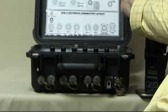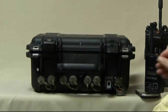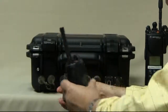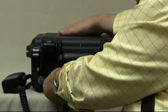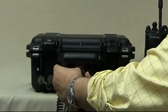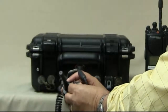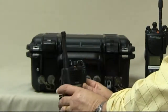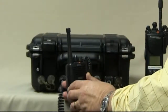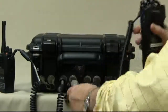The ICRI will operate closed after talk groups are selected and radios are connected. The connection of the radio is to one of the ports. The radio is turned on, and the volume control needs to be set at a mid position — halfway between fully clockwise and fully counterclockwise. The circuitry within the ICRI itself will compensate for any variations so that the levels going to the other radios will be appropriate.